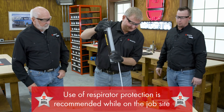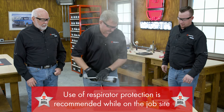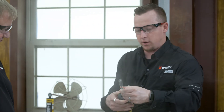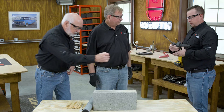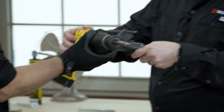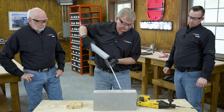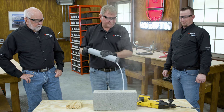That looks like a bicycle pump. Move back — we got a little bit of dust last time. Now we need to do something else here — put the brush. That goes in the hammer drill. You brush the inside of the hole. There you go — easy install. But we're not done. We've got to blow it out again. See all the dust that came out — quite a bit.